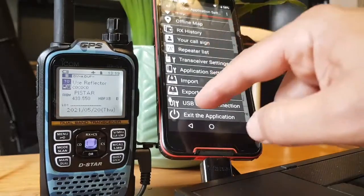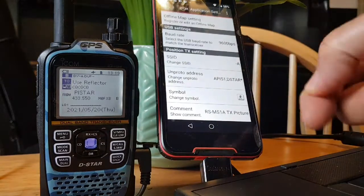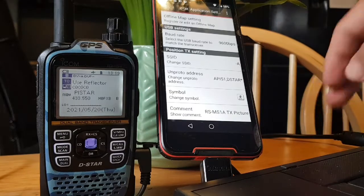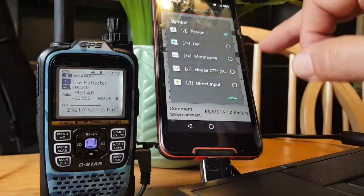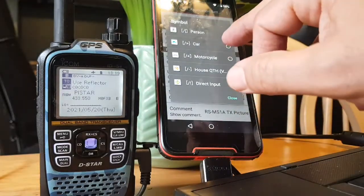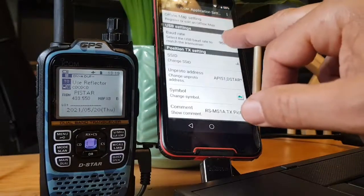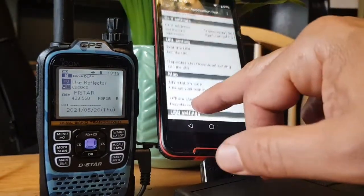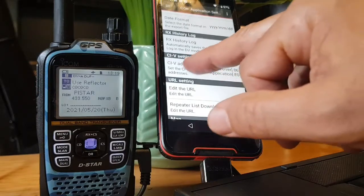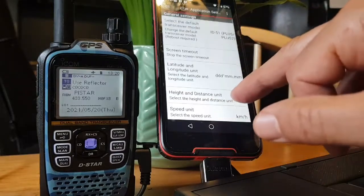Back to Settings — USB cable connection is there. What happened when I plugged in the USB cable to the phone, the phone said 'oh you're going to use the USB cable, is this OK?' so it sort of found it on its own. You can see the baud rate — USB setting 9600, CIV address 86. I can't see anything major that I changed.